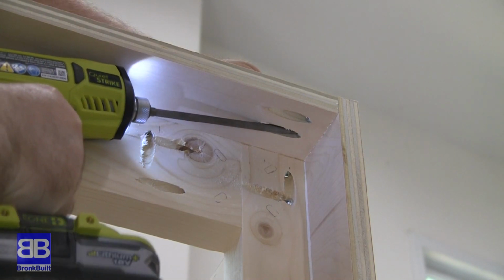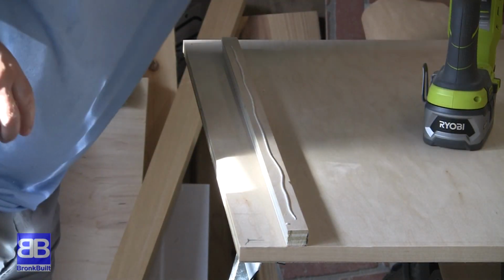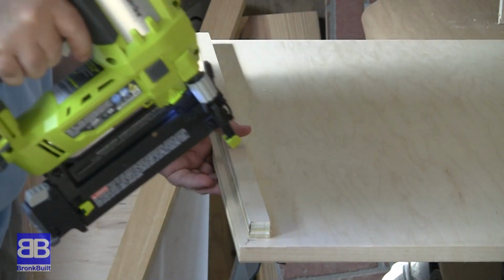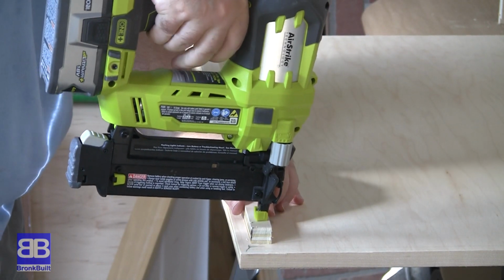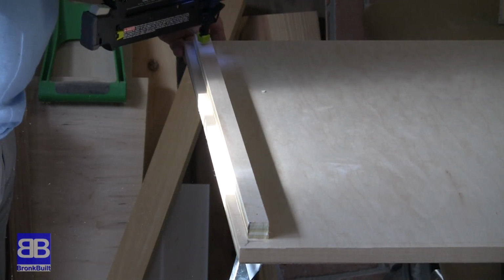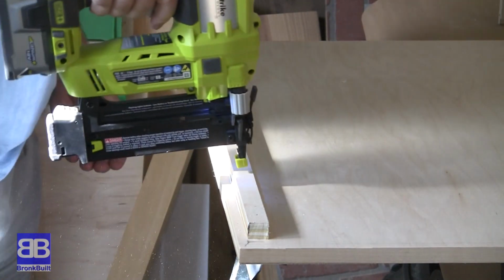While the back will be fit inside the rabbets on the sides, it will rest just underneath the top. So that the back will have some support at the top, I attach a scrap strip to the underside of the top, leaving room for the back piece. This will allow me to attach the back to the strip for a secure fit. You'll not be able to see the strip once it's assembled.